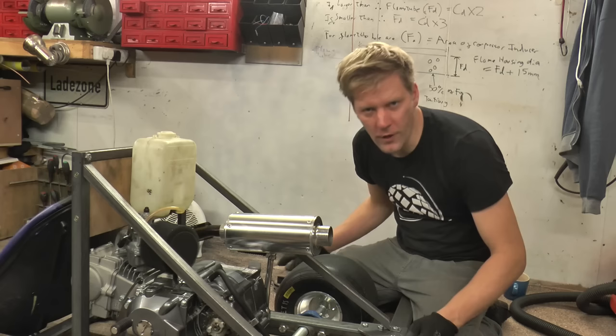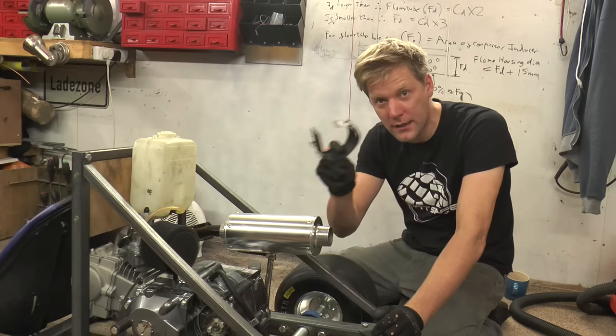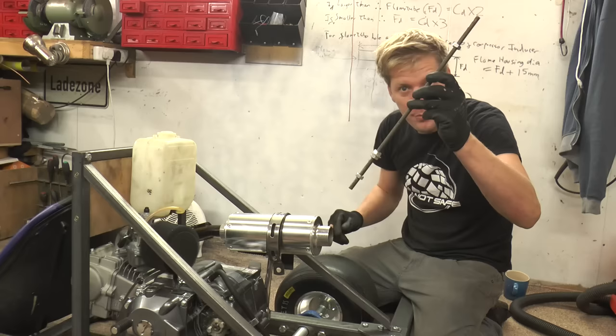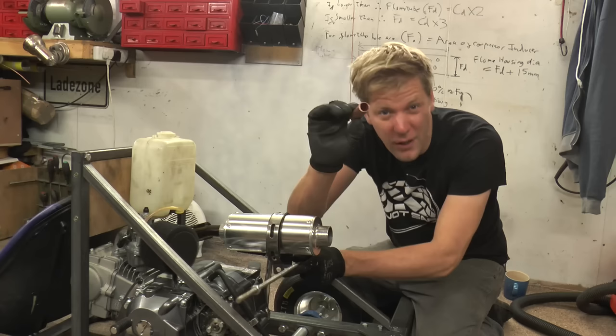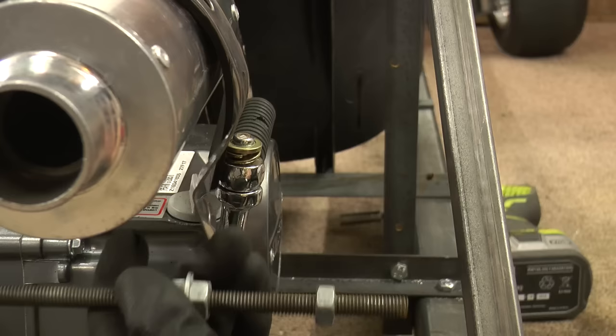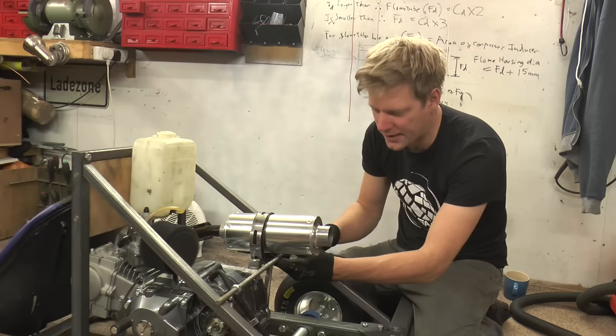Right, the exhaust is fixed and looks very nice, but we can't just leave it hanging — it's only connected to the engine and will work its way loose. We use this little band clamp that comes with the exhaust, stick it round the can, then get a bit of threaded bar and drill holes in the uprights and thread it through the clamp. Also get yourself a bit of 22mm plumbing pipe — pretty much a set of handlebars — to go in the end there. That also holds the little start/stop switch, which all comes with a wiring loom. That'll be nice and secure, nice and neat.